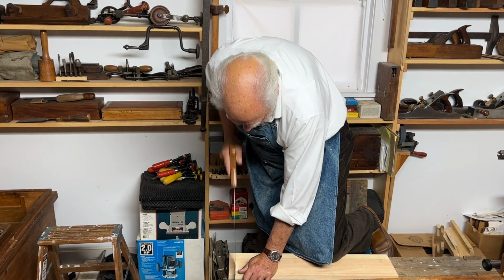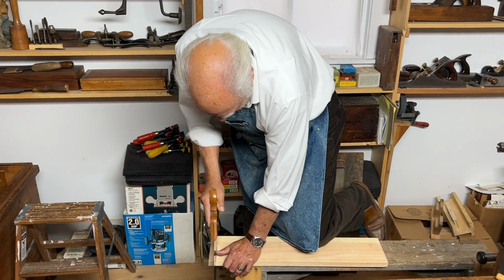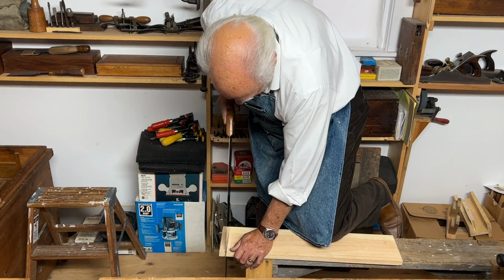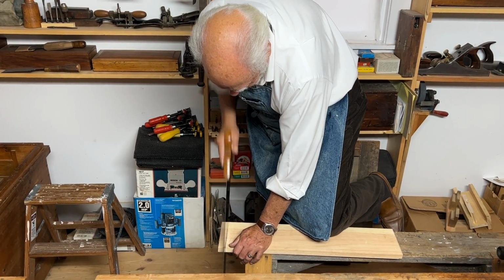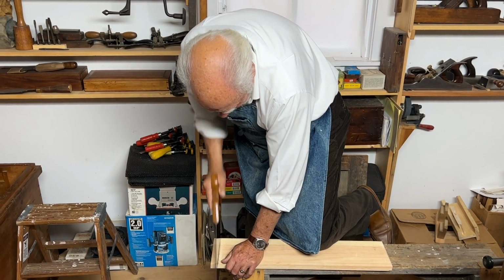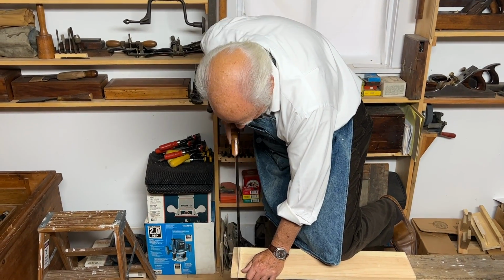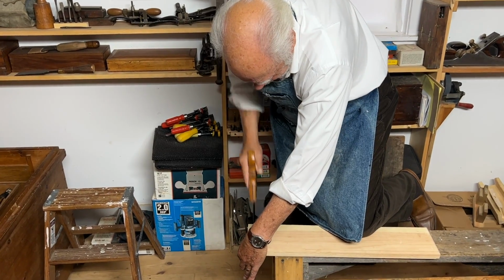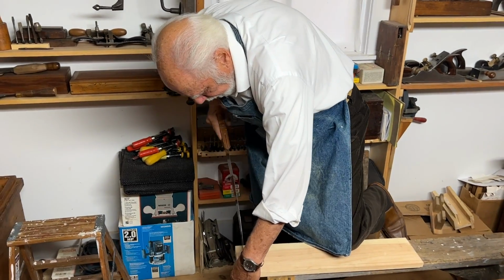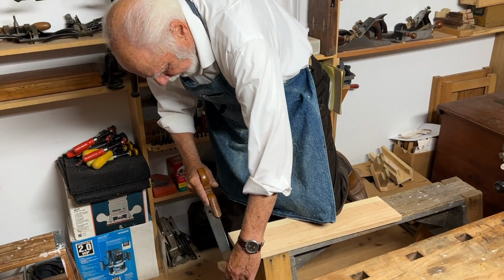So all you do is with 3 fingers and a thumb to prevent any unexpected damage, using the entire length of the saw down on the waste side of your line. When you get close to the end, it's often good practice to hold the end of the piece that's sawing off so that the last few strokes don't break off the end of the wood, but you get a nice clean cut.